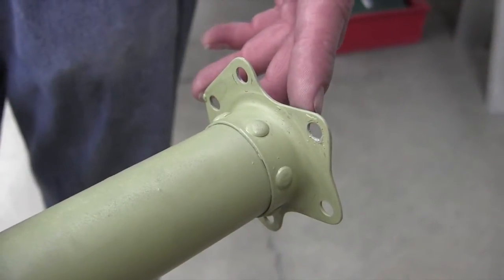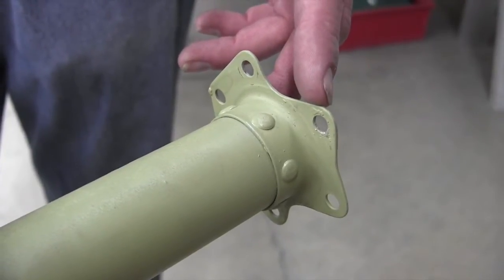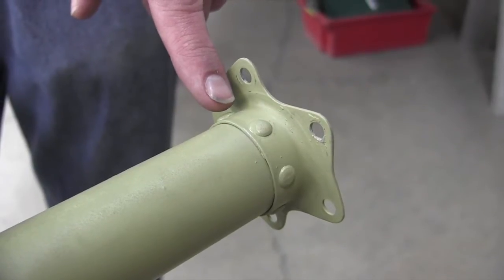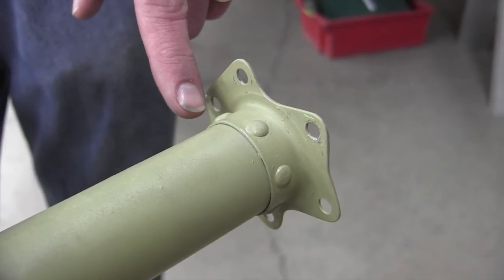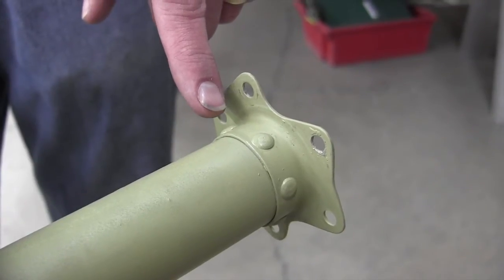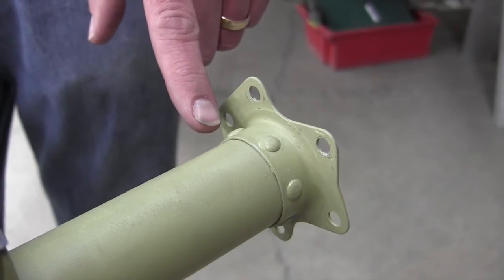While working on the Cessna 182 elevators, another area that you might look at and inspect as well is the rivets around the collar on the torque tube at the inboard end of the elevator. These rivets are prone to working since they are in a shear load continuously. So while you're working on the elevator and doing service bulletin compliance, this is a good area to go looking for loose and working fasteners as well.